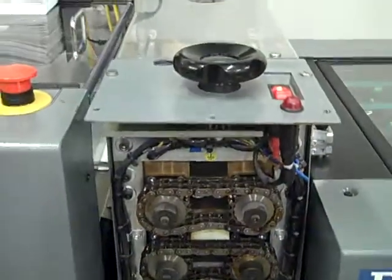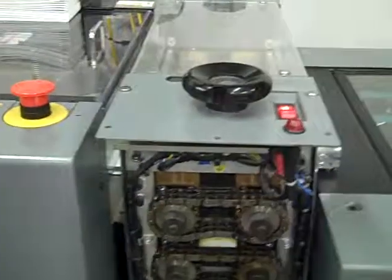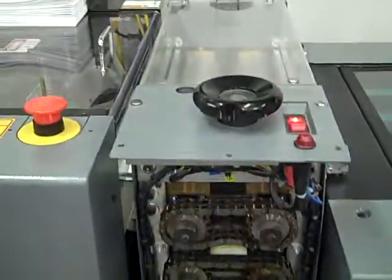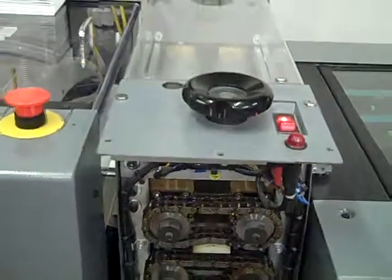It's very similar to Borg's design except that the rollers are smaller and closer together, which eliminated a lot of the issues and problems that Borg had with theirs — because there was too much space between the rollers, the booklets would have a tendency to ride upward and then buckle the fold going through the second set of rollers.